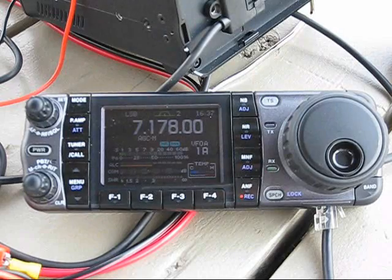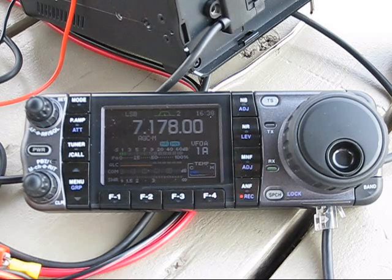So back to this setup — I like it, though it's a little heavy because of the battery. There are lighter battery options but they're much more expensive. I like having a solar panel; it gives you some power when it's sunny and even in overcast I get a little charge. It's 1.8 amps at full sun, so it can charge the battery through part of the day. I usually store it in a backpack. I just want to show this as an option for being set up for a grid-down or SHTF situation where you don't have communications.